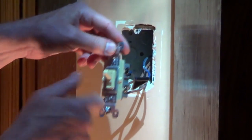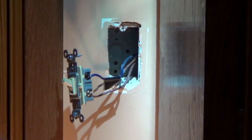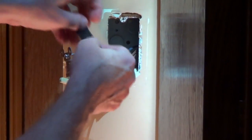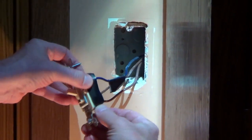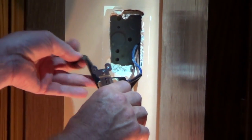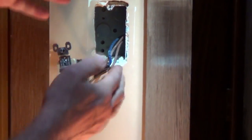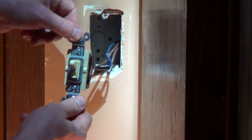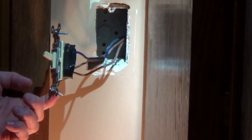On a three-way switch it is not marked on or off, so it doesn't matter which side is up or down. As a safety measure, I'm going to wrap the screw terminals with a piece of electrical tape. Because we have metal boxes, this protects someone in the future who might not shut off the electricity — if they pulled it out, they could short it against the metal box. That's all there is to it — very simple to wire a three-way switch.